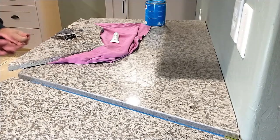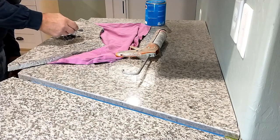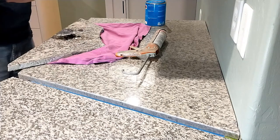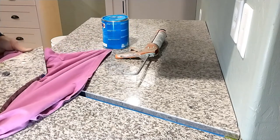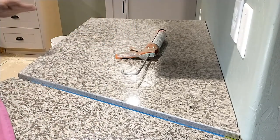Those are the colors I want to use. I'm going to go ahead and add the hardener. It's 3 parts to 100 parts on this hardener, so I'm just eyeballing it. It really goes fast. It's not particularly warm here. I'm going to move this out of the way, the other side here. It's a little chilly right now.